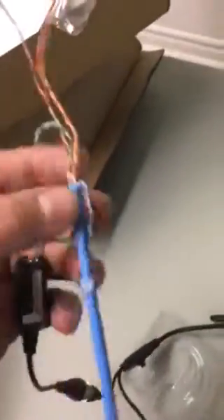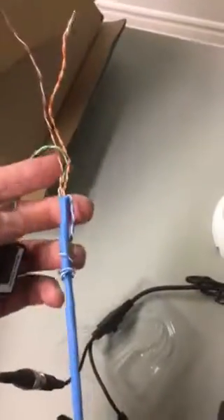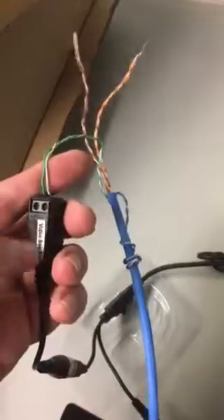To do that, we'll take a regular CAT5 wire, we'll strip it. Over here we have four pairs. In my case, I only used three. I doubled up orange and brown as positive and negative for power. And the green pair — a single pair — is used only to connect to the balun itself.